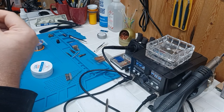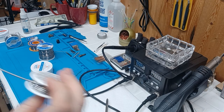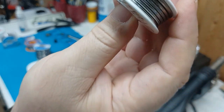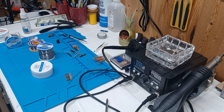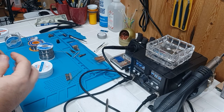Your solder sitting here — it's contaminated, just like I showed you earlier. See how cruddy and oxidized that is? Now look at where it hasn't been in the air as much — it's nice and shiny in there. That shiny stuff will work way better than the crappy oxidized stuff. You don't want to be messing with lead solder like this anyway. If you do, wash your hands afterwards because eating or smoking with that on your hands — well, California says it'll give you lead poisoning. Be careful with the lead. I think the stuff from Fat Boy probably has lead in it, so when I get off here I'll go wash my hands. I don't put them near my mouth.